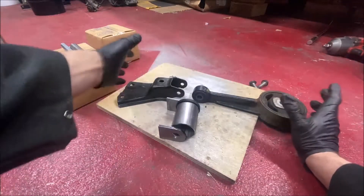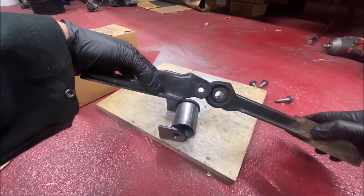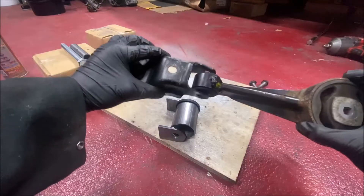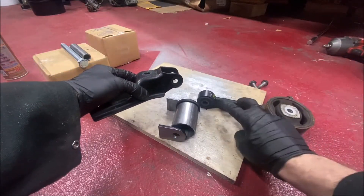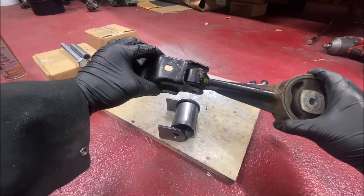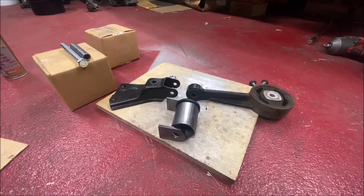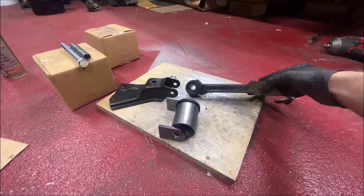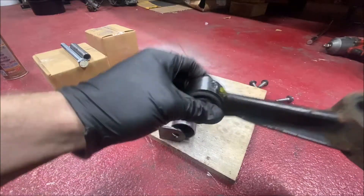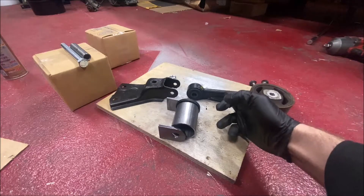There's no way this is going to fit as it is - it's also a completely different bush size. As you can see the holes are different, the bush is bigger and there's obviously a gap there. Now you could just chop this bit, extend it, drill this out very slightly and then just pack it with washers - that would be the bodge job way of doing this rear mount. I'm going to go down a different route simply because that bush is scrap - the rubber is torn and it had some play in it when I was driving.